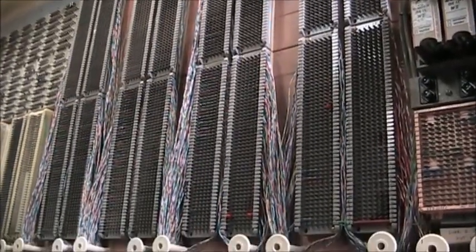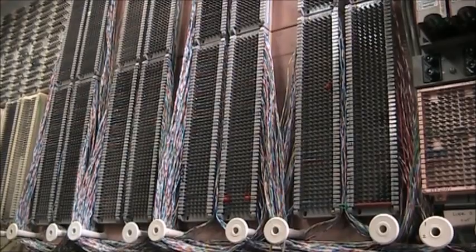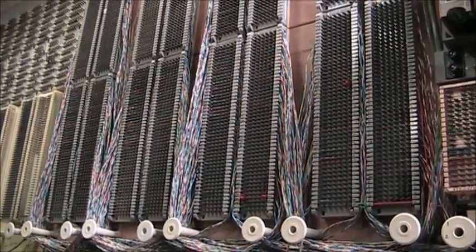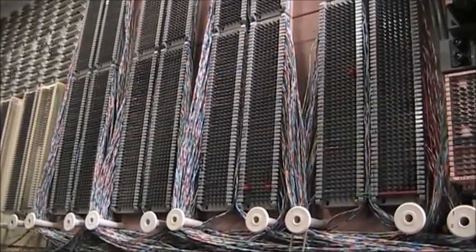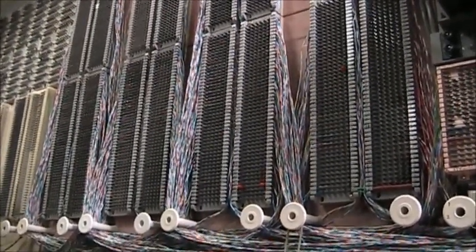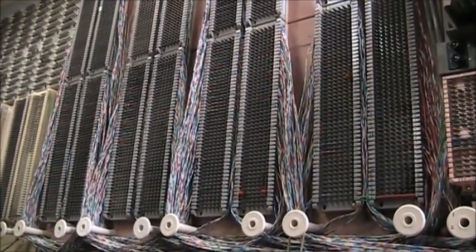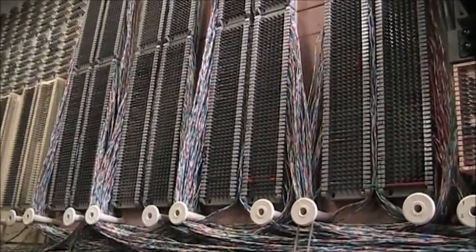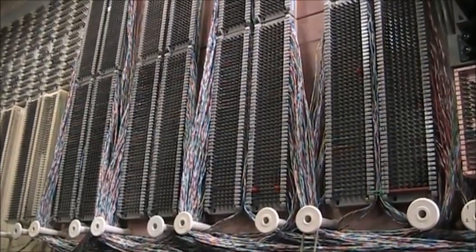Here I'm showing the 66 blocks used for multiple appearances of the same line. The gray blocks have one lug that connects to the KTU, and then the other five lugs are capable of being cross-connected to telephone sets. So if you have a system with a lot of telephones with the same line appearance, you would run a cross-connect from the 620 panel to one of these blocks, and then cross-connect to the telephone stations as required. I have approximately 70 telephones on the first three lines of this system throughout my property.